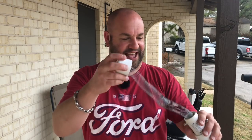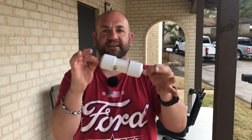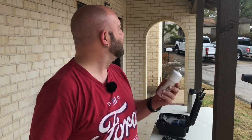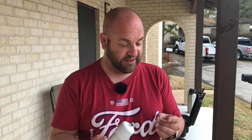It took me literally about a minute to set up — just pop it out, stretch it, hang it and you're done. This is cool. Another cool thing you can do with it: these two ends are actually electrically connected, so if you wanted to take an alligator clip and extend it, give it some longer radiating elements, I suspect you'd have better results just because you have longer wire. Just how clever is this thing? I just got on the air and made a couple contacts in a few minutes with it just a few feet up in the air. Obviously if it were higher it'd be better. You could take this out to a park and do some POTA with it. If you're in a compromised antenna situation like I am and haven't figured out what to do, you can just take this out, throw it on the roof, make some contacts and play radio. This is cool.